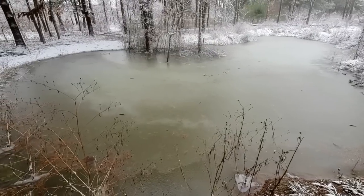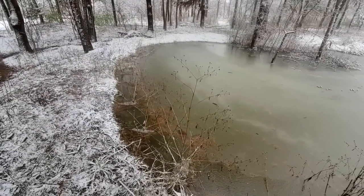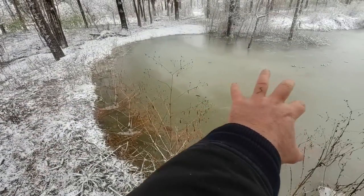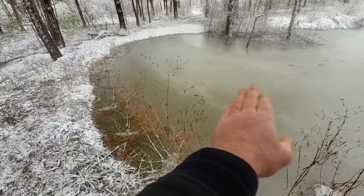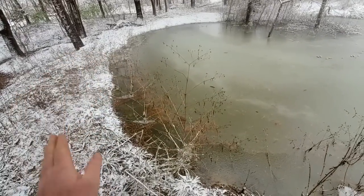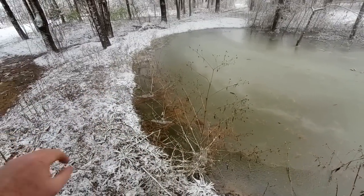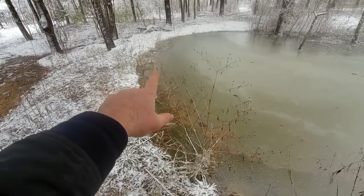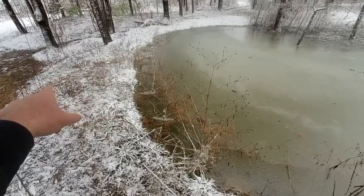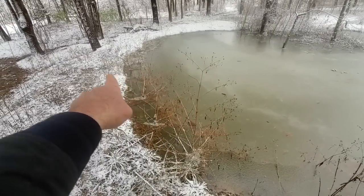Standing here on the retaining berm, making a couple observations that I'd love to share. One is that the berm itself, that is this right here, is the subsoil that was excavated or moved with the skid steer and then eventually the excavator out, and packed and tracked in on this end to hold back the water that's coming in. So this is responsible for holding all of this. If the water were to start flowing over the top, breaching that, it would start to erode faster and faster, and especially with intense rains and more incoming pressured water, could blow this out.